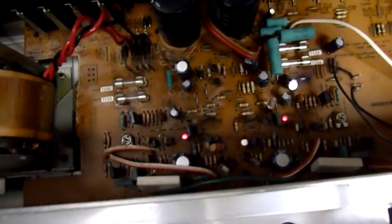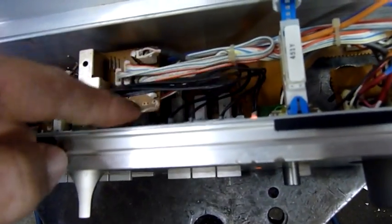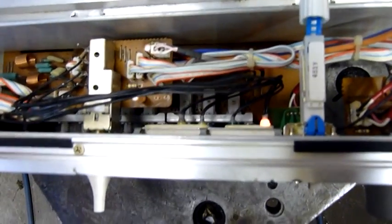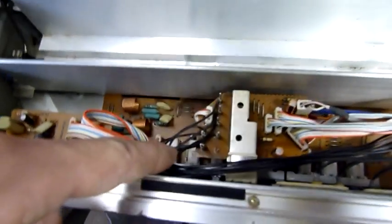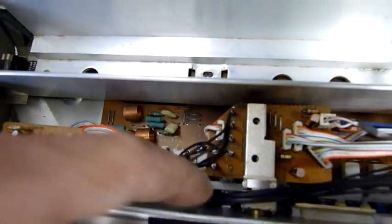Yeah. Indicator lamps are on. It's just some of these actual neons or whatever they are dead. I'm going to replace them with LEDs. That one's got a green sleeve over it, so I can get a green LED. I just have to work out what voltage they are. Yeah, there they are coming off there. It's easy enough to rework.